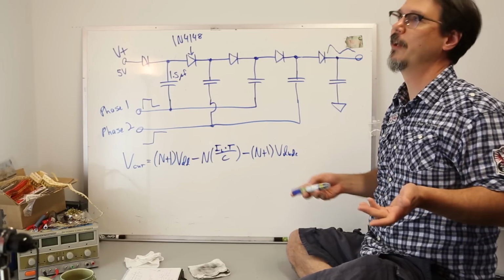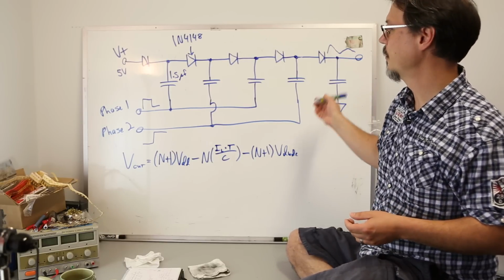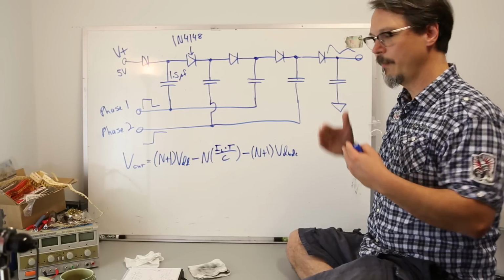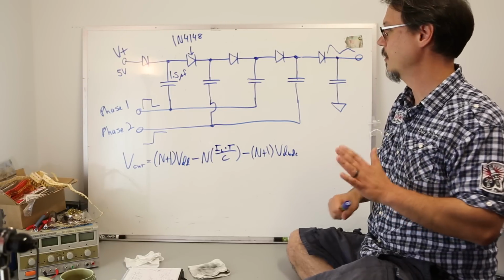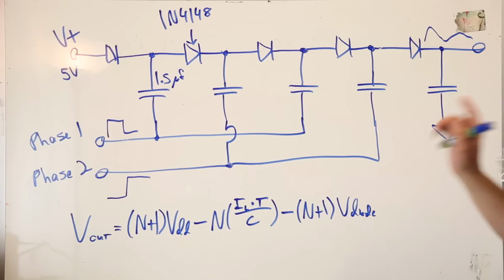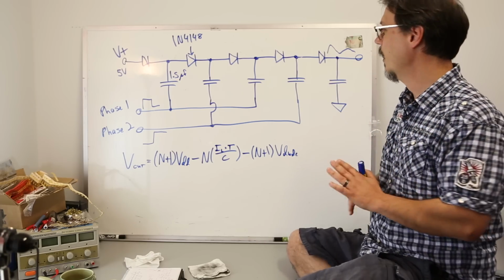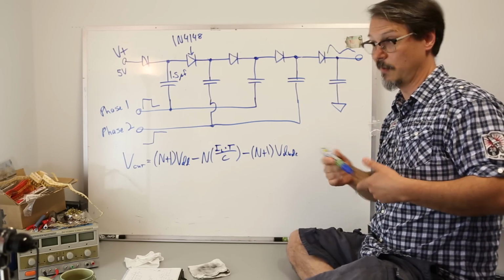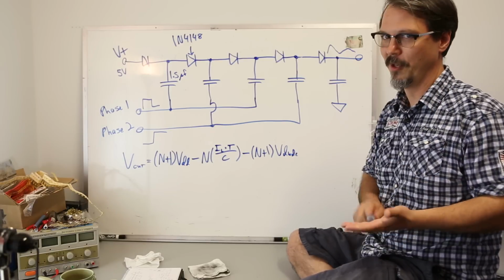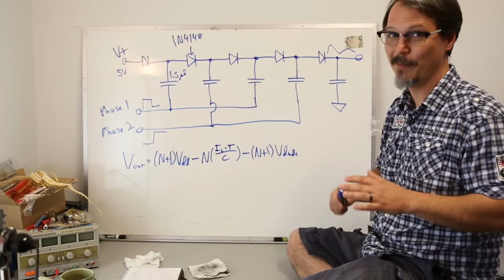Originally I was running at I don't know how many kilohertz, and I bumped it up as much as I could, but originally I'm driving this thing with a red board. And the red board is good, I like it, it's a real good piece, but the timing of that clock was jittery as all, okay? So ultimately I switched to one of our FreeSoC boards, because I had one in my hands because I really want to learn how to use the PSoC chip. That thing has a lot of potential.